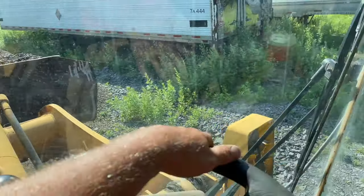I had to do a bunch of dirt work. I stole a bunch of dirt over here and put it over in this hole here. That's what she looks like. I had to do a bunch in the back here too. Drops off pretty quick, but serves the purpose. We're just loading things up. We're gonna go home and cut this foam. We gotta cut 10-inch pieces of foam to go around this. Once we strip the form, after we pour it, we'll put foam up against here and backfill it, probably with some of that fine stone. So that's what she looks like.